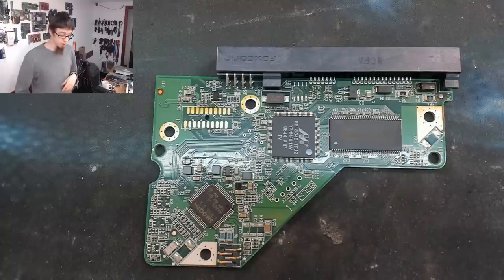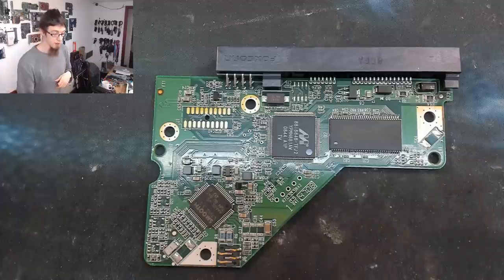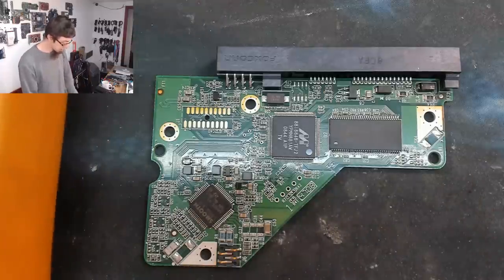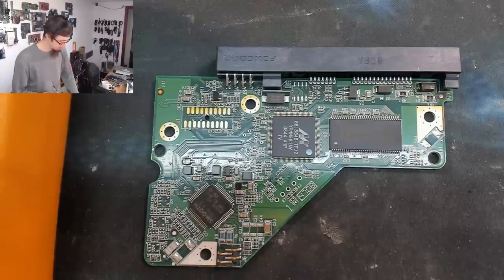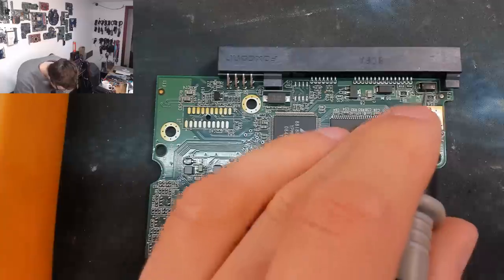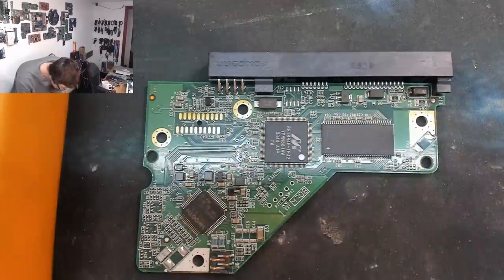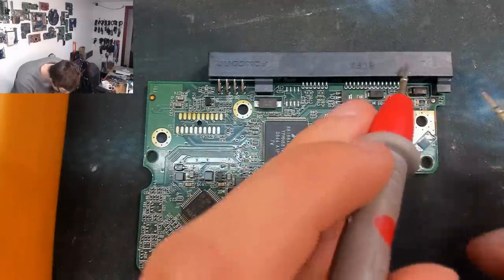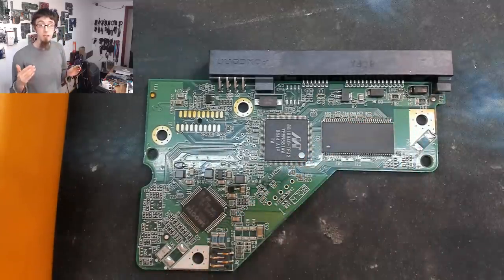So what I thought on this one, I was like, well, sure, let's take the diode off just in case it's failed. And once again, I can show you this in action, multimeter into continuity mode. And if I check both sides of this, as you can see, it's in a dead short circuit in both directions. So once again, we can see our short circuit there.